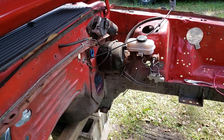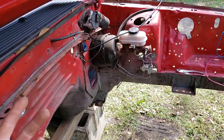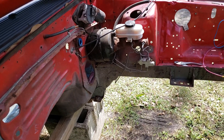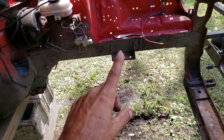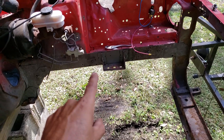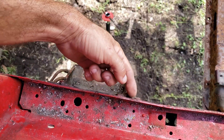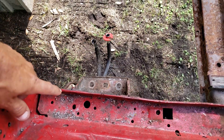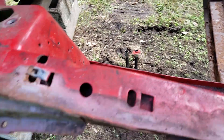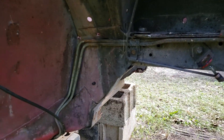It'll make it all look a lot better. I'll fill those holes in behind the brake booster — even though you wouldn't really be able to see it, I still want everything to be smoothed out. I'm not going to get rid of the sway bar or anything like that, so when I cut it, it'll just take the top of it off and I can re-weld it when I weld this plate on there. The frame rails aren't rusted, which is always good. Floors aren't rusted either.